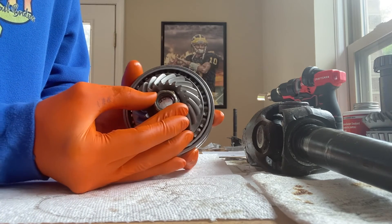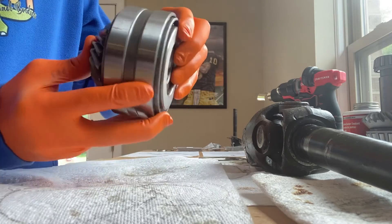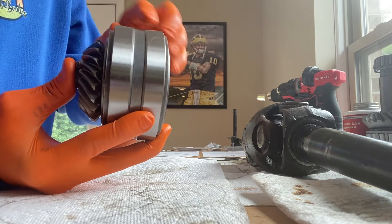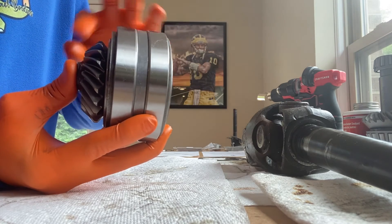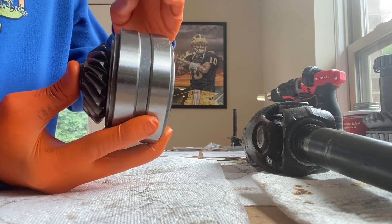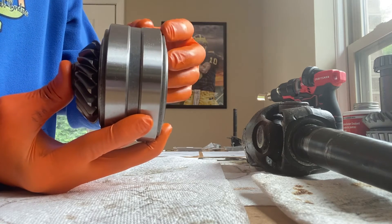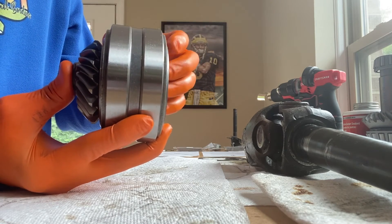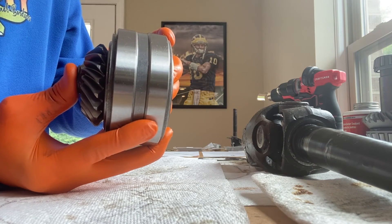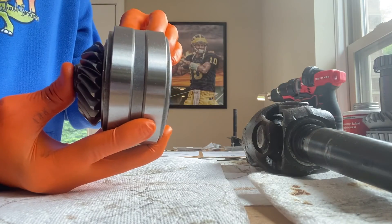Because it had to be pressed on, the nut goes on your shaft and you will begin your preload procedures. As you tighten the nut to get the proper rolling torque or resistance within the bearings, you'll tighten it several times until you get the correct reading. Because it is a press fit, you cannot move the inner carrier by hand — but when it's in the vise with the retainer nut tool and you're tightening with your socket and ratchet, you will be compressing the inner carrier and bearing closer to the gear, achieving the proper preload of 6 to 10 inch-pounds for a brand new gear and bearing set, following the new press fit design procedures per the manufacturer. This smaller ring or spacer is not to be used with a new set of gear and bearings.